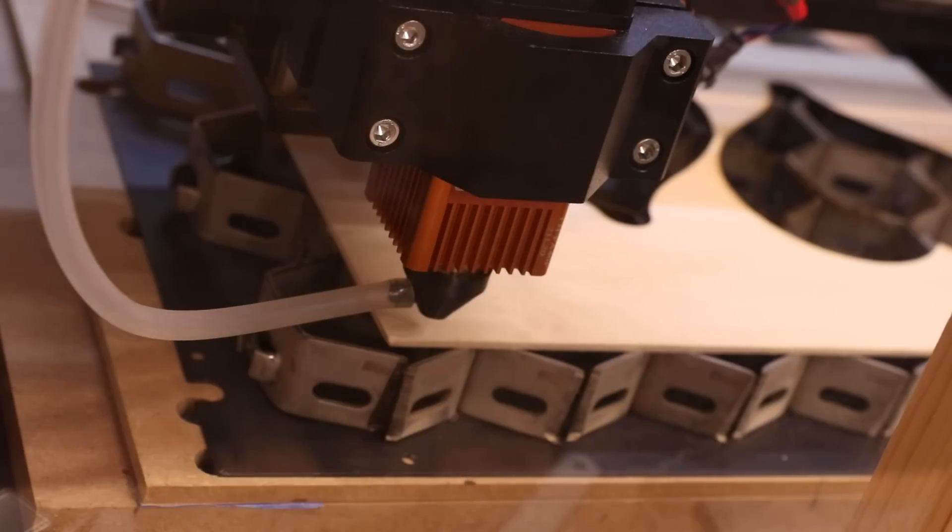This is a new and more powerful diode laser, but we've already done a whole range of tests and experiments with other lasers reviewed in the past — check out the laser playlist in the corner. To save stretching the video out, we're just going to focus on some tests we'd expect this higher quality laser to do, such as some deeper cutting tests. The first test is quite simple — a speed cutting test. We've got some 3mm bass wood on the bed and we're going to cut out a series of hexagons, all at 100% power, starting at 300 millimeters per minute and going up by 50 millimeters per minute for every cut.